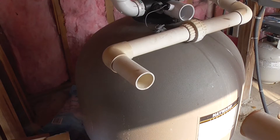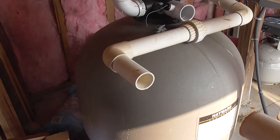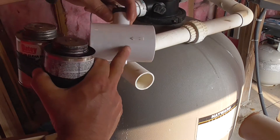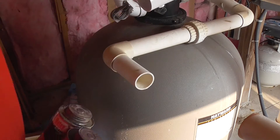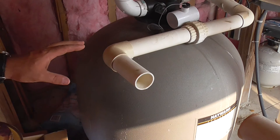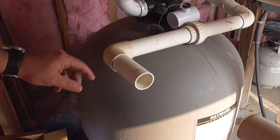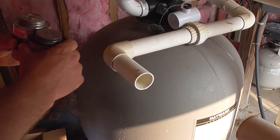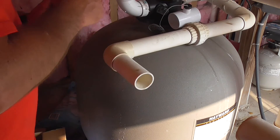I have my first pipe prepped. What you need to know is that this unit has a flow switch, and you can see there's an arrow — so it's directional and we need it to go this way. What the flow switch actually does is prevent your saltwater cell from burning up in the event that the pump turns off and there's no water inside the cell. To do this, the first thing we're going to do is prime up our pipe.